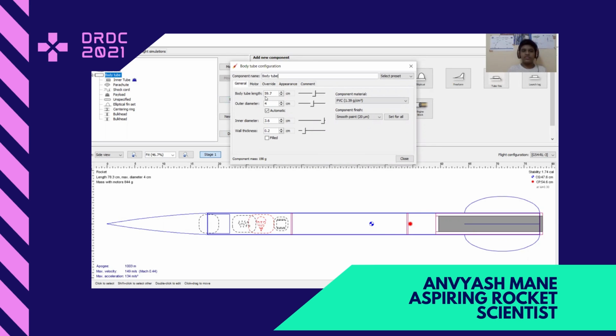After that, body tube length is 59.7, outer diameter is 4, inner diameter is 3.6, wall thickness is 0.2. The component that I have used is PVC as it is lightweight, strong, and very durable and can withstand forces from an 8 meters per second squared impact too. And I have tested that.